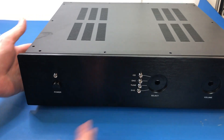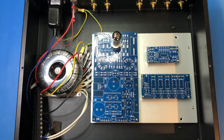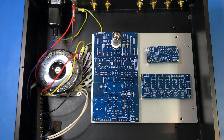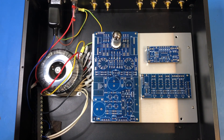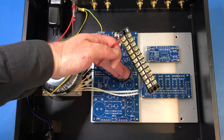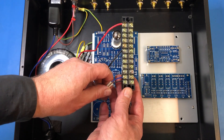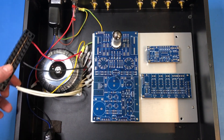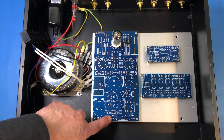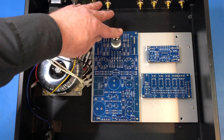Now let's have a look inside and see the overall plan. This is the general layout. These voltages are connected to this terminal strip just for testing purposes — 12.6 volts AC and 200 volt AC, the only taps needed. They will go into this board, which is the actual Marantz 7 clone board itself. It has its own voltage regulators down here — a couple of bridge rectifiers — which will make a regulated heater voltage and a regulated HT voltage.